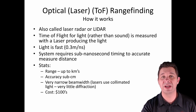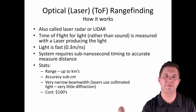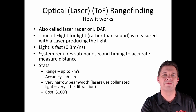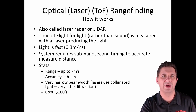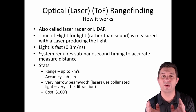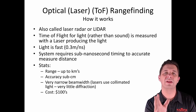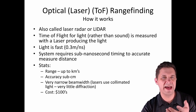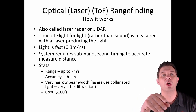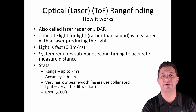In terms of range, LiDARs can be short-range or very long-range, up to kilometres, though accuracy decreases at much longer ranges. For better quality LiDARs, sub-centimetre accuracy is achievable. They also have a very narrow beam width — using a fine laser beam rather than a wide spread like sonar — so we can measure a single point, or by moving it, a group of single points. LiDARs vary in cost: fairly inexpensive ones can measure a single point, while those that scan a full 2D plane cost thousands of dollars.